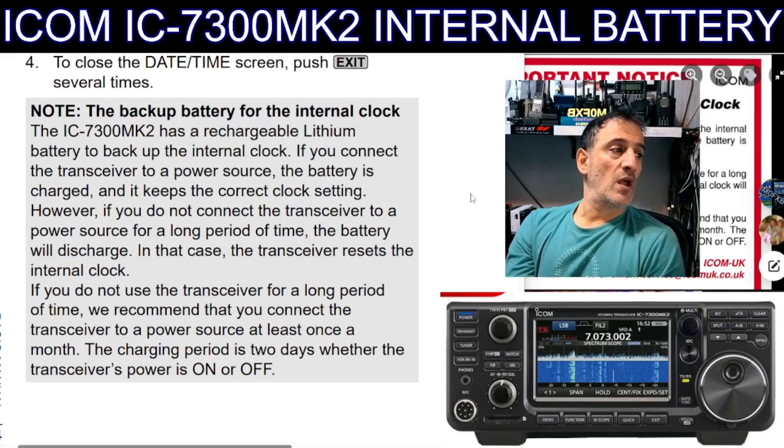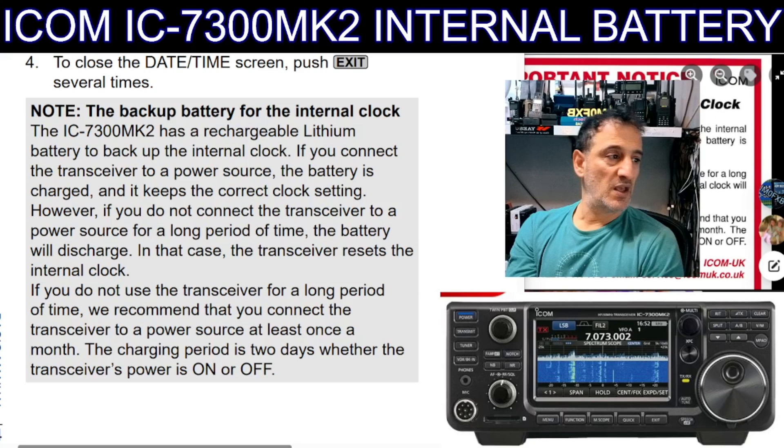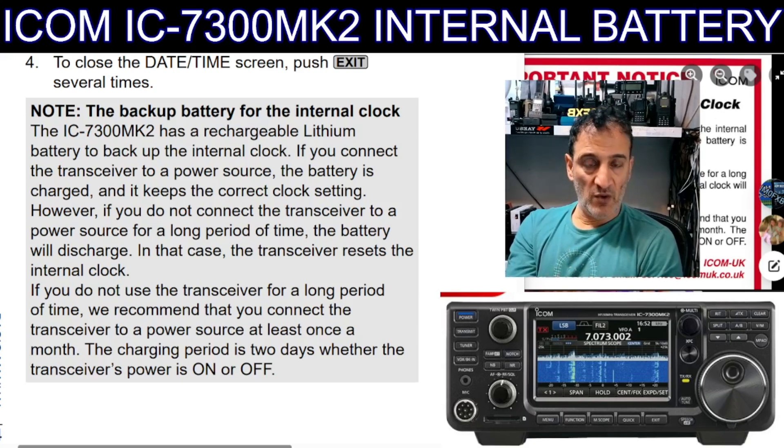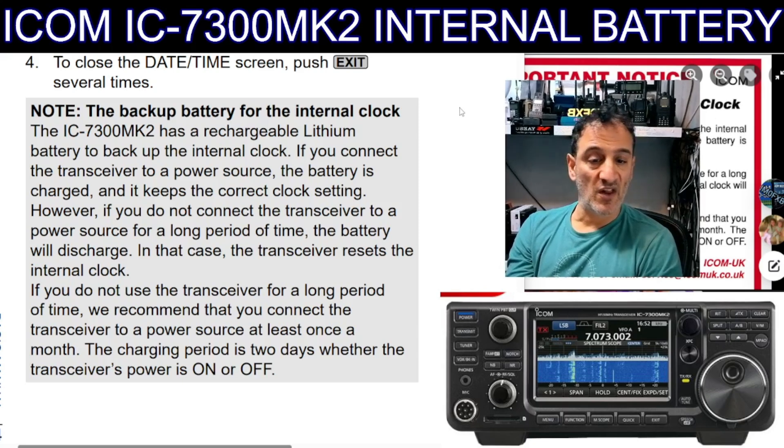That's an identical message. I feel that if you've got a radio that gets very old to the point where the rechargeable battery has degraded beyond use — which is really unusual in my opinion unless it's very old — there is a chance you'll have to go in and replace the battery. But it's not that hard; it's basic soldering. You can send it to your local ham radio shop like Martin Lynch and they'll do it properly, charge you a fair price, and you'll have a warranty. I don't see a problem, but please ICOM confirm: if the battery has seen the end of its life, like any rechargeable battery, it will need changing.